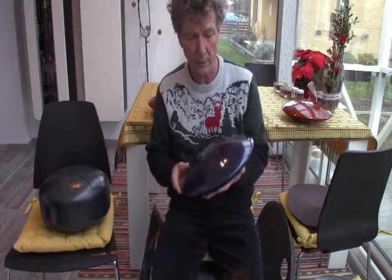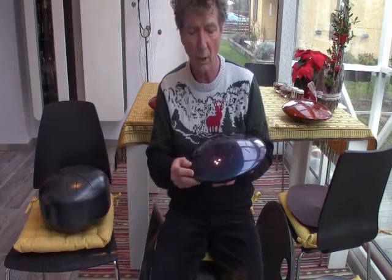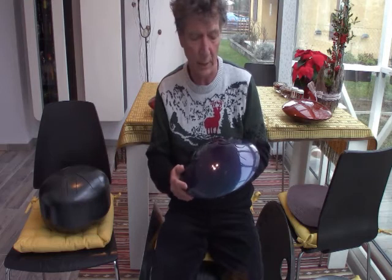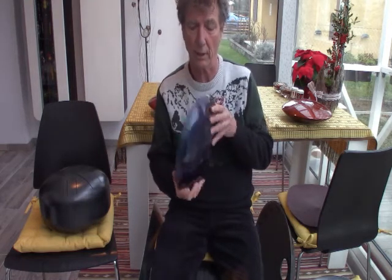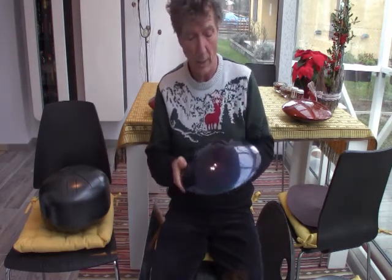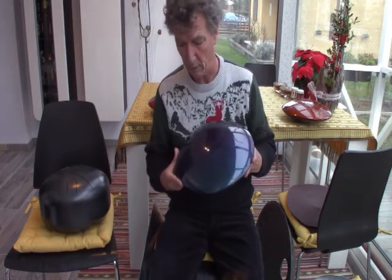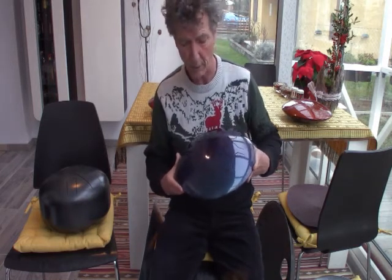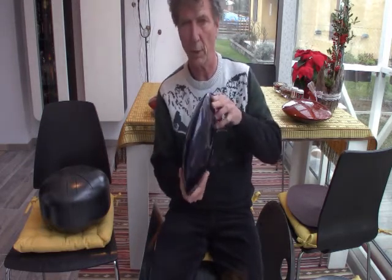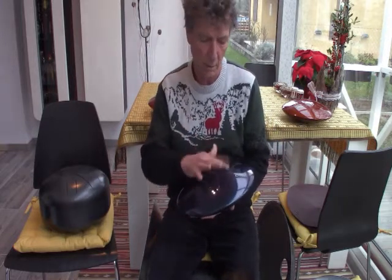We add one coat, do some treating to it, then put another coat on, and these two coats react with each other chemically to form a really strong bond. What we end up with is two coats of paint bonded together to make a really hard, scratch-resistant — not scratch-proof, but scratch-resistant — paint with a really high shine that lasts for a long, long time. It's a little more complicated and a little more expensive, but we're being a good friend of the earth by using the powder coat, and we've come up with a good, hard, strong finish.